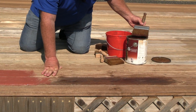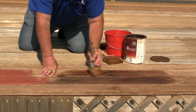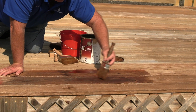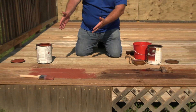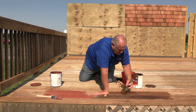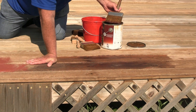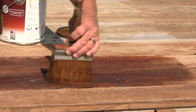With the staining brush, put a little more on, then leave the brush on the wood until there's no more product. When it runs out, reload with just a little and work your way down the deck keeping a wet edge. If you lift the stain brush it will leave a brush mark — this doesn't happen with paint or solid stains because the opaque finish fills in imperfections. With a sealer or semi-transparent, any improper brush lifting will show. Keep the brush on the surface all the way, reapply with just a little at the edge, and keep going across.